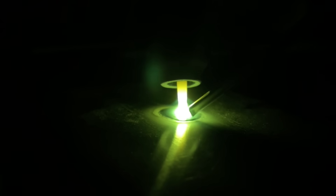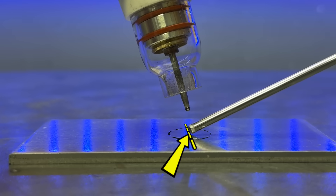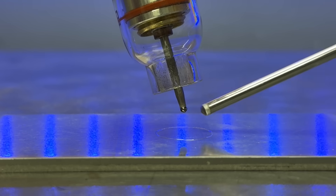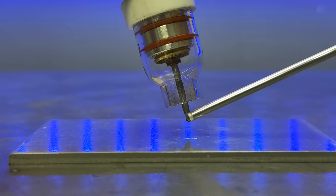Now let's talk about the filler material. Look at this footage — the filler rod is going into the puddle super clean, no problems at all. You want to feed your filler rod into the sweet spot, which is halfway between the leading edge of the puddle and the center of the puddle. I cannot stress this enough for beginners. What you do not want to do is feed the filler material to the center of the puddle, as that will cause you to pull back your standoff distance or arc length, and you also have a much higher probability of accidentally touching the electrode with the filler material.